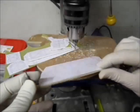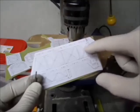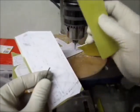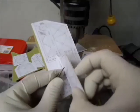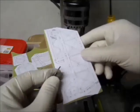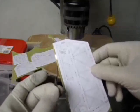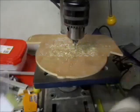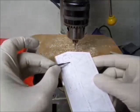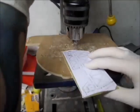Now before I start cutting with the fret saw, I'm drilling the holes in here. So basically the fret saw blade doesn't turn in the radius, so I'm drilling 2 millimeter holes. And for the things that have to go interlocking each other, the fiberglass is 1.6 millimeters thickness, so it has to sink in there. What I previously was doing, getting a 1.5 mil drill bit and then fixing with the fret saw, but now I got these carbide tips for the mill CNC and ease off my work a little bit. So I'm just getting the hole in the router in manually, and then all I need to do is fix a little bit with the file, and that's it.